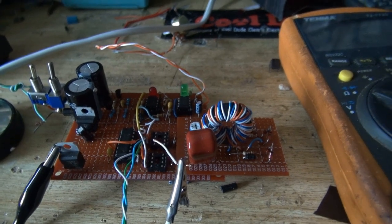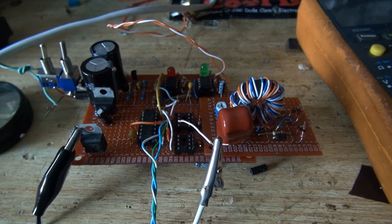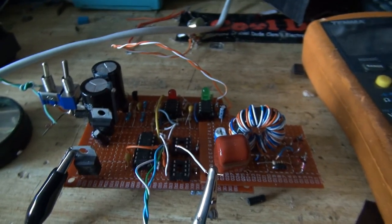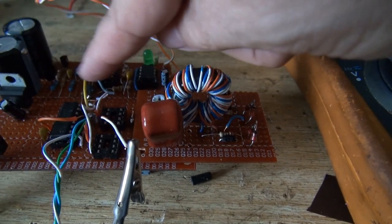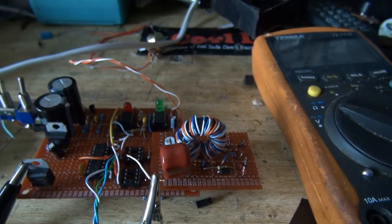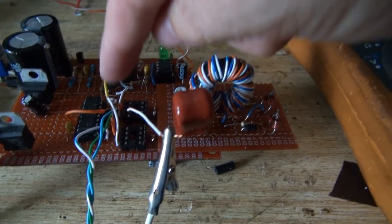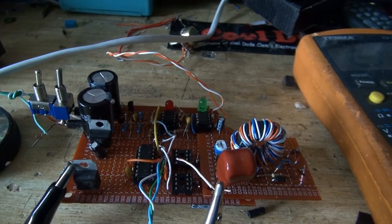Well, the curse of Cool Dude Clem strikes again. So it seems that I was wrong about something. I tested all the wiring, and for once, everything is connected where it should be. But I thought, when I have no mains frequency going into the interrupter, it would be giving constant DC output. Well, that doesn't seem to be the case. I'm gonna have to go back to my original plan of using a switch between the interrupter and the gate driver chips. So right now, I'm a bit PO'd.